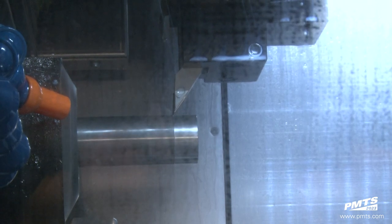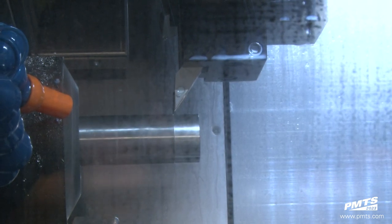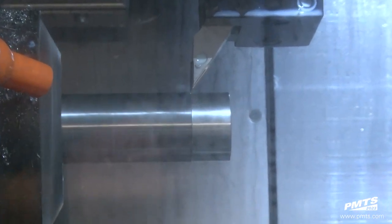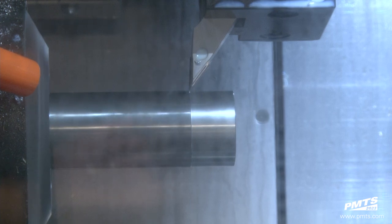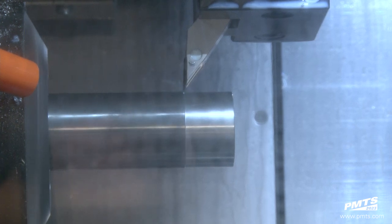This is a 42 millimeter machine, inch and five-eighths capacity, 6,000 RPM main and sub spindle RPMs, 6,000 RPM rotary RPM for any live tooling. It's got a four and a half inch travel in both directions in the sub spindle so it can reach either turret very easily.